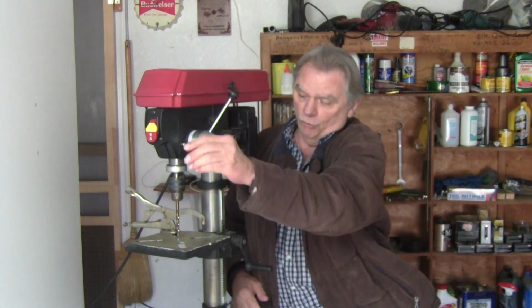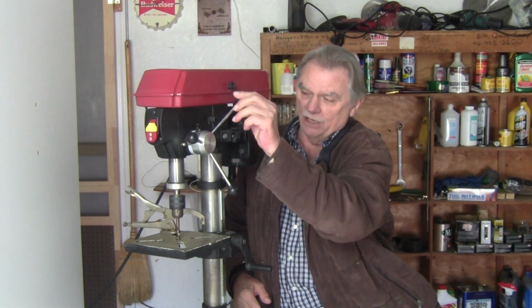Next would be your 2-inch stroke. That means this will drill down 2 inches and then it stops. Okay, this benchtop model, most of them are about 2 inches. Floor models, you can go 3-4 inches. For me, 2 inches works great for all the projects you see on my YouTube channel.